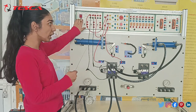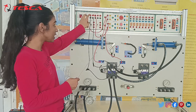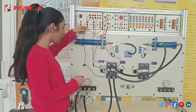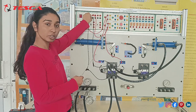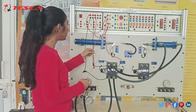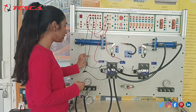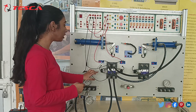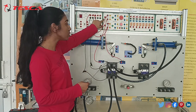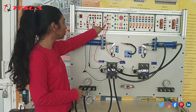As it is an electro-hydraulic trainer, we have taken the supply from the SMPS to the NO of the switch panel, and the same we have done with the other terminal of the DCV. We have given the positive of the push button to the positive of the DCV and then the other terminal of the DCV to the ground. We have used two push buttons here — one for forward movement and the other one for the reverse.